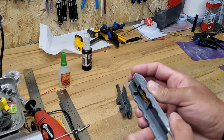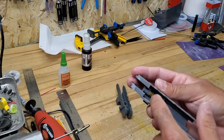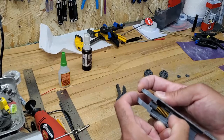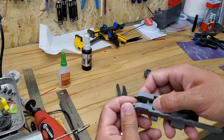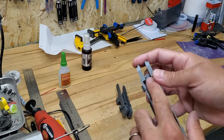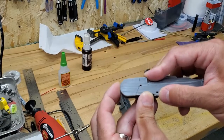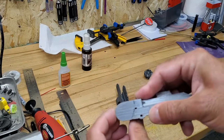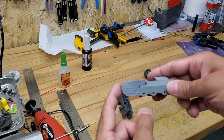You're going to need to find a 4mm rod and cut it to length to fit inside here — there's a hole in the back for the 4mm shaft and it'll stop just shy of the end. The spring is there to control the tension. I'll be adding extra little cylinders here in case the tension isn't enough, because you don't want track skipping. We also include a solid shaft option if you want to keep it solid without a spring.